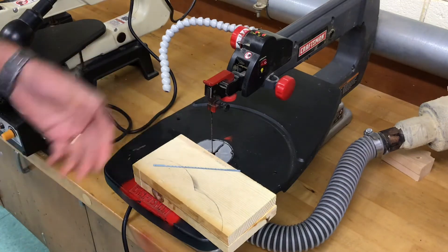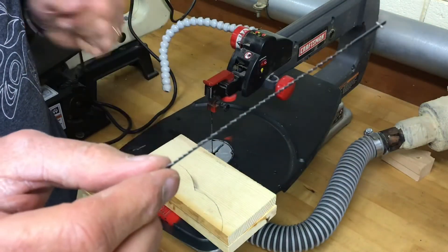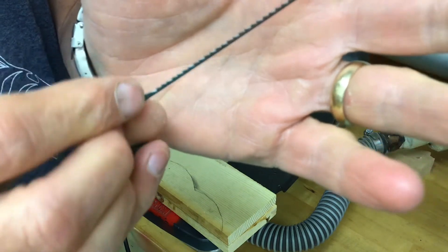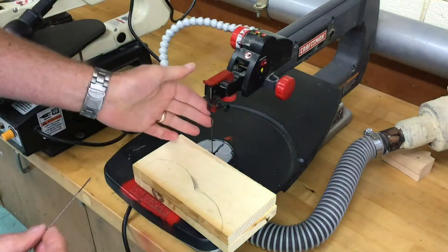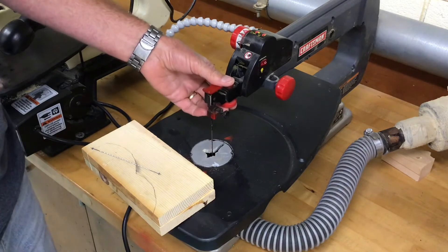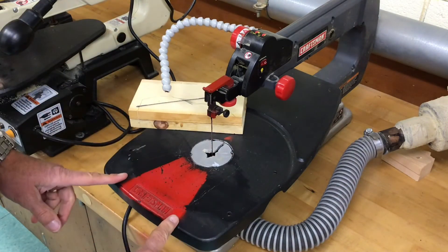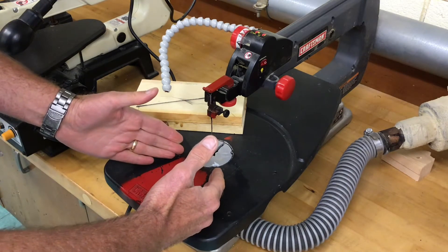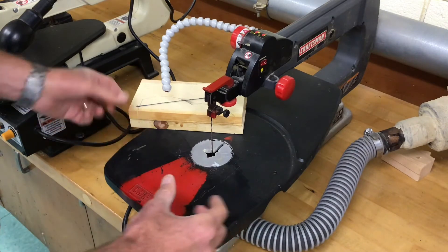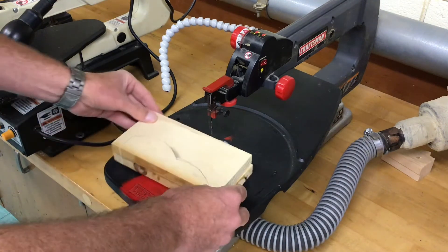With a foot pedal it's pretty cool — the other ones you have to reach up and turn the thing off if something goes wrong or the blade gets stuck on a project. I'm going to show you one of the blades and parts of this saw and some safety things to consider. The scroll saw blade is super thin and very sharp, but the main thing to know is that the blade only moves straight up and down. It's fastened to the saw — it can only press up and down like the needle on a sewing machine. So it can't hurt you as long as you keep your hands away from the blade itself. We painted a red zone here as the cautionary keep-your-fingers-out zone — your fingers should stay outside of this red area. Hold the project with two hands, keeping your thumbs and fingers out of that red boundary zone, and you'll be fine every time.